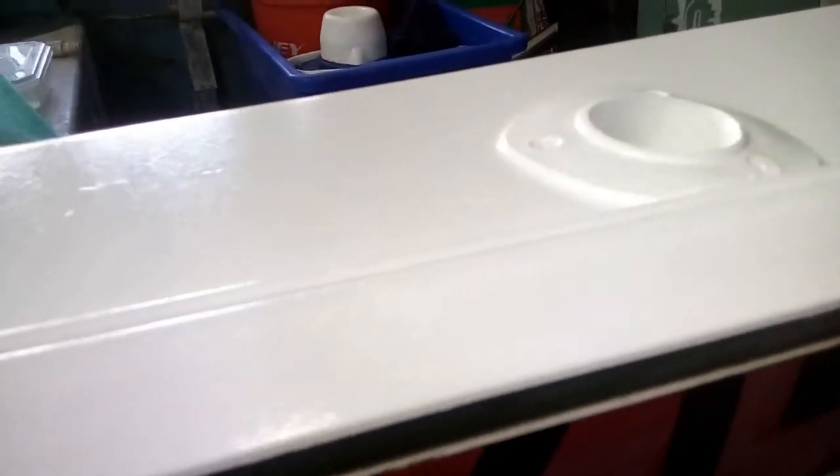This is actually a top coat you're looking at now — the enamel coat. It's a gloss enamel I had at home. If I chose again, I'd probably go with a low sheen or semi-gloss — it doesn't need to be gloss; it's glary enough out on the water and it will dull off pretty quickly. You can see where it meets the existing paint it's a bit of a mess, but wait until you see what it comes up like when finished. Here's a pretty good sand of the port side, ready for cleaning down and masking up like the other one.